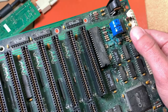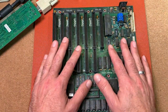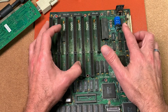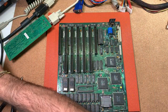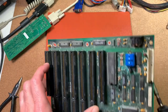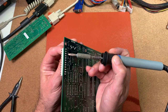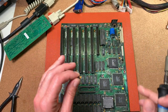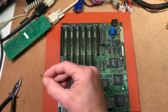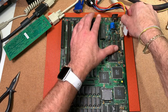Of course I could have avoided this by measuring them with a multimeter, but obviously I didn't do that. So I've got here now a bad smell in my whole room, and some additional issues to fix on that board. First of all, I will desolder this defective capacitor, and I will try again if the board is posting. And here we have this small capacitor which was shocking me so much. So this bastard is desoldered — let's give it another try.